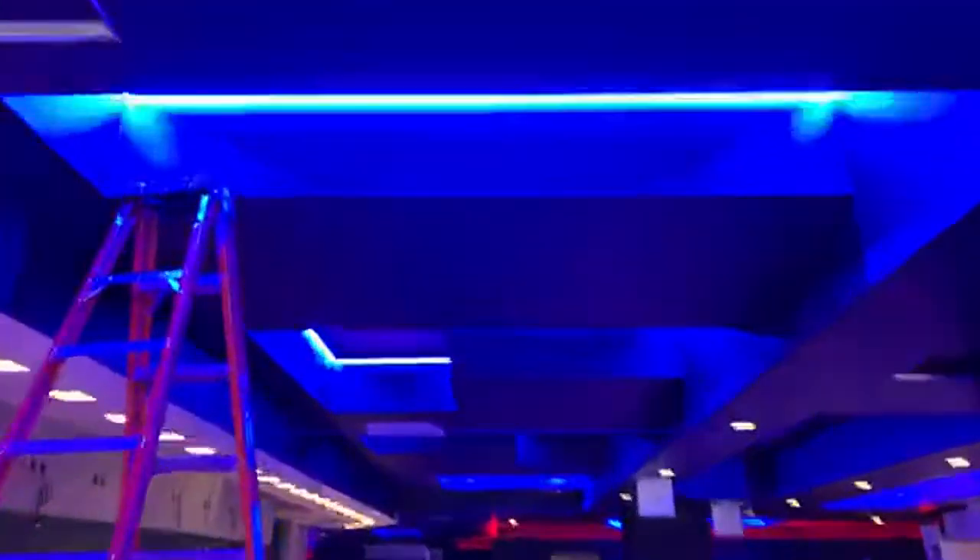This is how we do it. It's framed out first with metal studs — 18 gauge. Then it's sheetrock, then prime paint. You don't have to do the actual ceilings over here. All the soffits are painted matte black. Then the profile is installed around the perimeter, and after that the high-density lights are still exposed with no diffuser installed in the profile. This niche would require about two power supplies as the lights are at nine watts per linear foot.